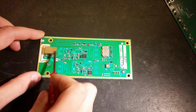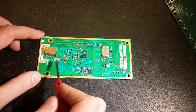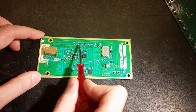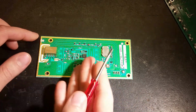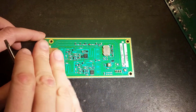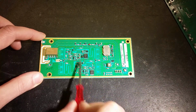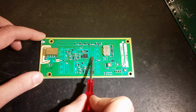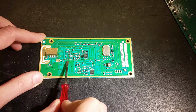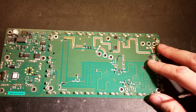The signal comes in here, but this one has a relay that can switch the signal to go this path to the output, or it can go through the relay, through some filtering, to a phase changer here. That makes this one signal into different signals, one negative 90 degrees, one positive 90 degrees. This one had two other amplifying units here, and pretty similar paths as well. One longer, one shorter. This one has a longer path here, and the other one here. It goes into this relay and out from the output. So they are pretty similar architectures in both circuit boards.